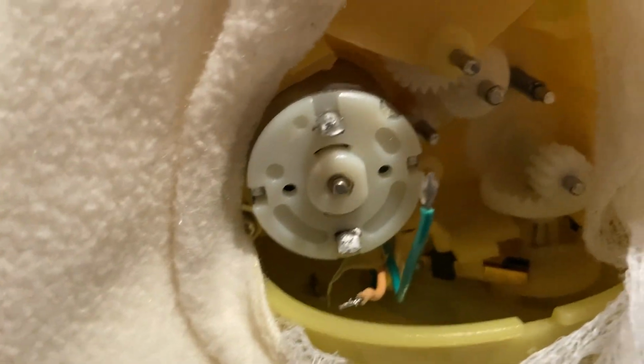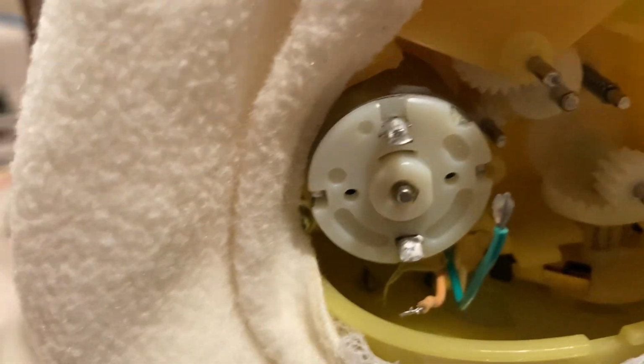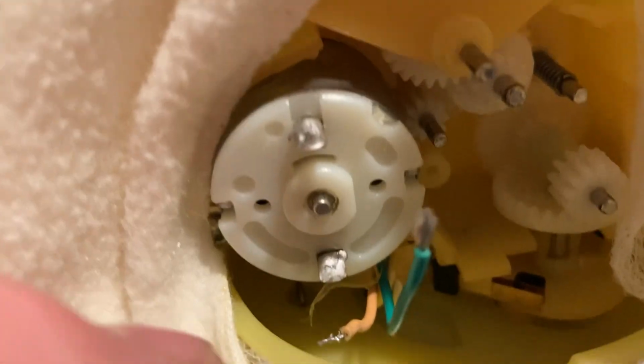And you know what happens to grease after that many years if it sits around. They had a lot of grease around the commutator, and the two little brushes were completely coated, and that grease had hardened, and it kept the little brushes from making contact on the commutator.